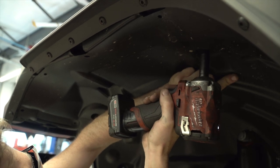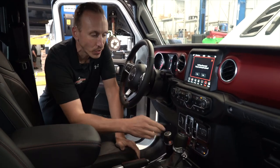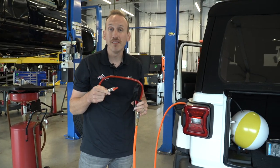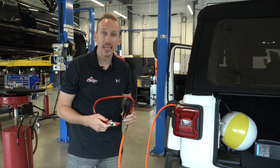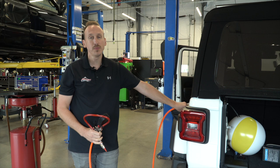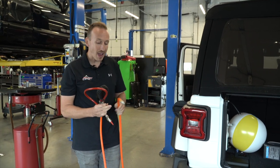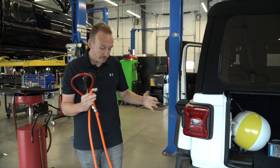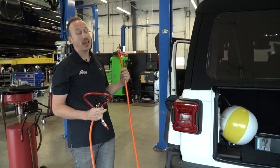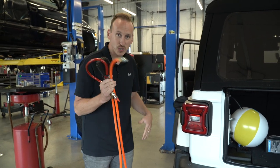Something to note when you're all done using your air — make sure you do it the safe way. Turn off the air compressor and then bleed out all of the air from the airline. Once there's no more air in the airline you can simply push the button and take the line out. If you try and remove this airline with it full of 120 pounds of air, this thing will blow out and it could clock you in the face. So if you're going to do it, make sure you do it the right way.